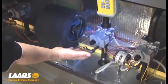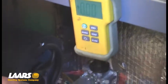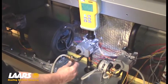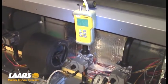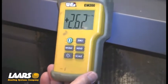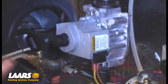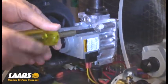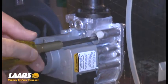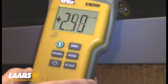With my barb in the butterfly fitting, I zeroed out the manometer again to make sure it's reading zero, and I'll hook up the hose. I'm going to open the butterfly valve and we're looking again for 2.5 on this valve. As you can see, we're running about 2.6. So I'll make a slight adjustment on that valve as well — simply removing the aluminum cap, using the number 40 Torx bit, making a slight adjustment, and waiting for the manometer to come down to 2.5.